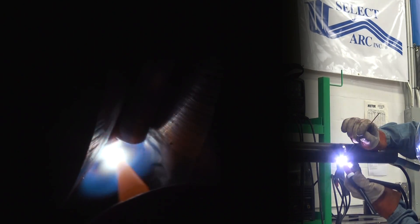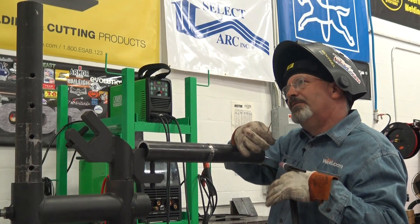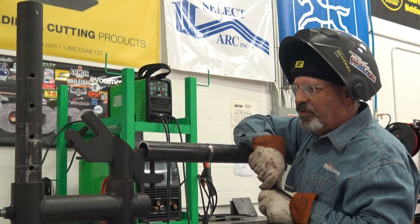So I'm gonna heat the leading edge of my tack. I'm gonna stay fairly tight down in the groove to make sure that that's hot. And I'm rolling the wire back and forth so I can feel it, pushing on it slightly so I know that there's filler wire going in. At that point I'm gonna snap out of it. I left a little bitty keyhole. And from here I'm gonna try to rest the cup in here and wiggle it the rest of the way.